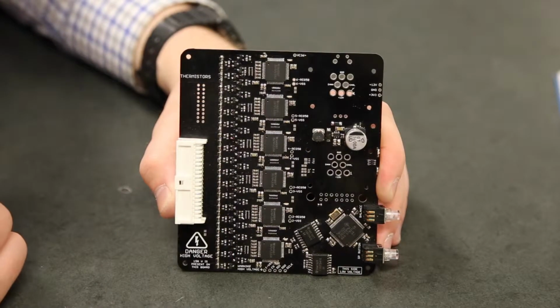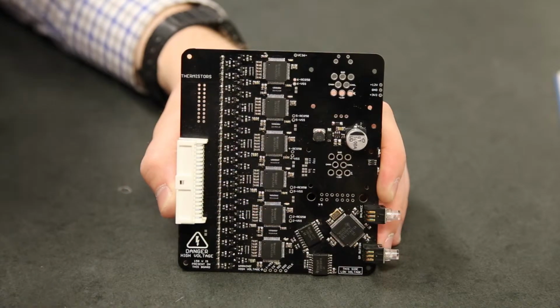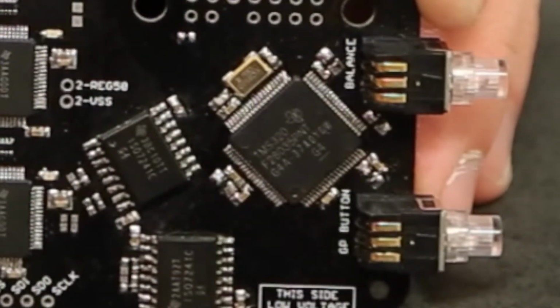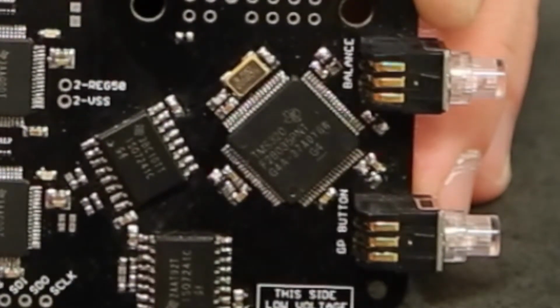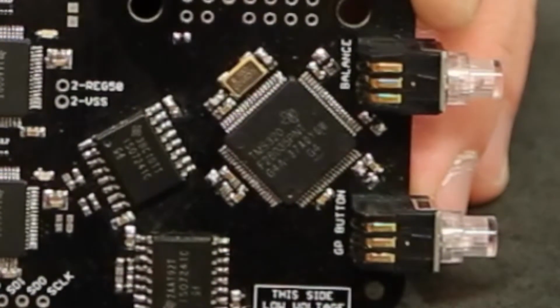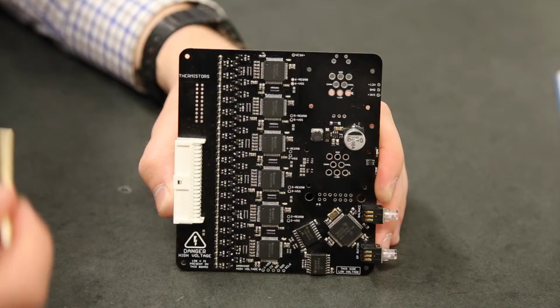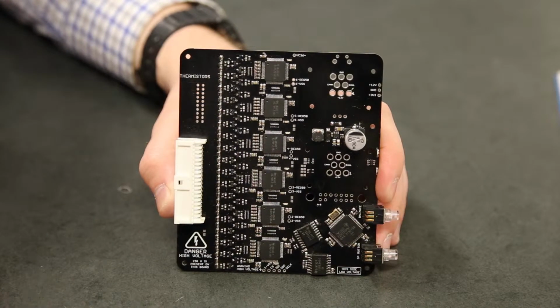Across the boundary on the low voltage side, we have the Piccolo, the TMS320F28035. This is the processor we use on all of our CAN nodes here on Buckeye Current, and it's proved really great for us because we have as much processing power as we need, plenty of onboard flash, as well as a built-in CAN module that handles a lot of the sending and receiving of CAN messages in the background. Actually, physically sending and receiving the CAN messages is handled by a CAN transceiver on the opposite side of the board, the TI SN65HVD230.